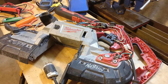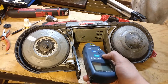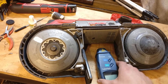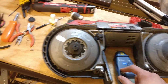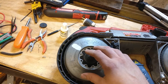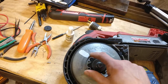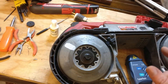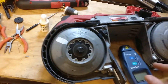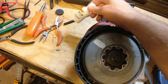Being from eBay, this is one of those no-refund deals. So how did I figure out the tool is only running at half speed? With a laser tachometer. You can get these for super cheap on eBay or Amazon and they are super handy. Basically they measure periodic reflections of the beam back into a sensor in the device. So here we have a strip of whiteout on the pulley, contrasted against the dullish metallic background of the pulley itself. So while this is not very reflective, it's still much more reflective than the surrounding surface, allowing the device to pick up the difference. These kits do usually include some reflective tape, which obviously is going to be much better at sending the light beam back into the sensor, but they also tend to fly off if you're spinning something at a high RPM. So I find myself using the whiteout much more often.